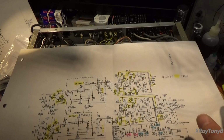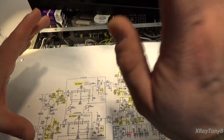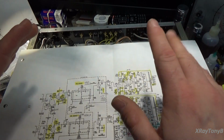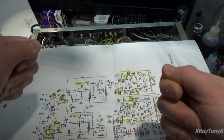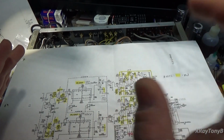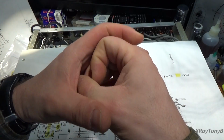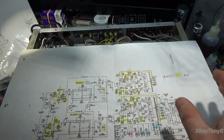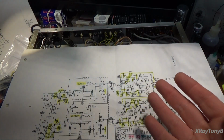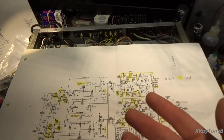The best way to explain that is if you take a loose speaker in free air, like a woofer that has a real high travel, or high excursion as we call it, if you tap that speaker, it'll have kind of a warbly low tone to it. But if you take the two speaker leads and you short them together with a jumper lead and you tap it again, the frequency will be higher and the speaker will have more of a thud to it instead of a ring. It's because that speaker is being dampened. In other words, the energy that's created by that moving coil on the magnet is actually working against itself because it's shorted. And a transistor, being a very low impedance device, helps that to happen. So it makes the speaker not flutter around so much when it gets moving.